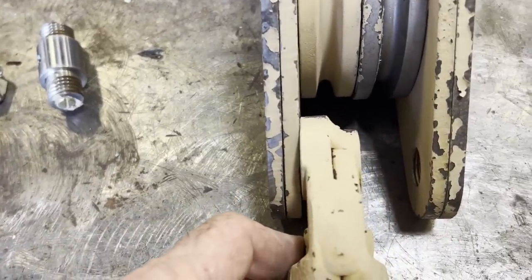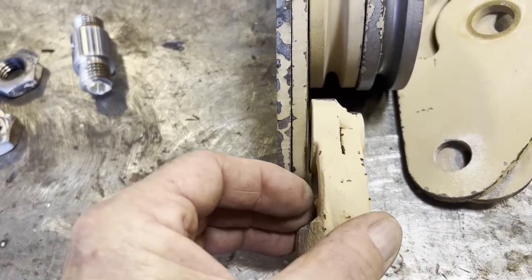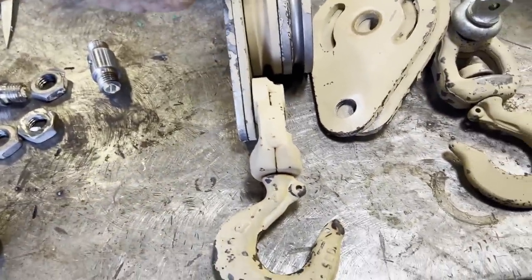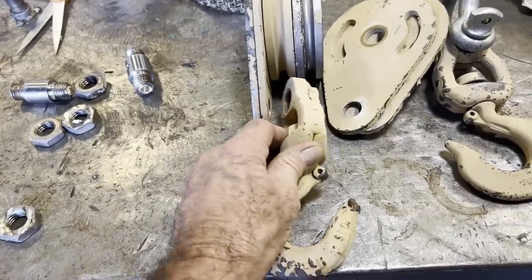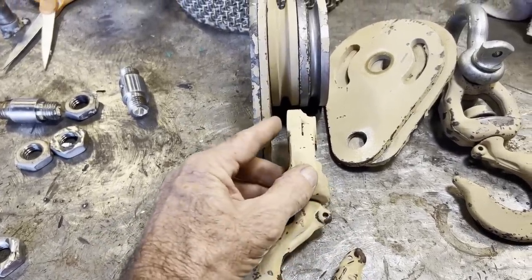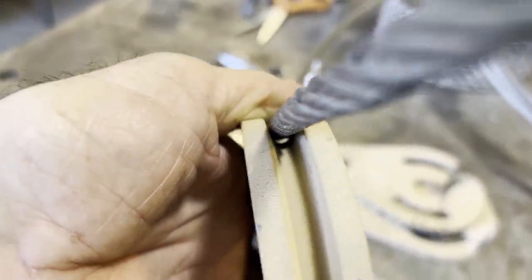And then on the pin that holds the hook, I'll have spacers on either side. If I want to just thread the cable through one pulley, then I'll just put both spacers on. In this application, they'd be on the right-hand side, so the hook's always pulling straight off from the pulley. If I decide to run both pulleys, then I'll put the spacers on both sides. I just want the hook pull nice and square, however the cable's set up.